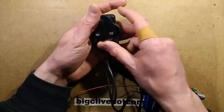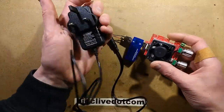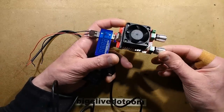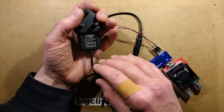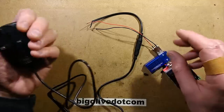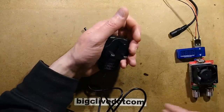Getting back to the power supply, I decided to give it a test. Since it's putting out 6 volts at 2 amps I used a USB tester — one of the larger ones with coarse and fine controls. I set it for about 2 amps. It does say 2 amps, and it got quite hot and then it died. It didn't do anything weird other than getting quite hot and dying, which is pretty weird in its own right.